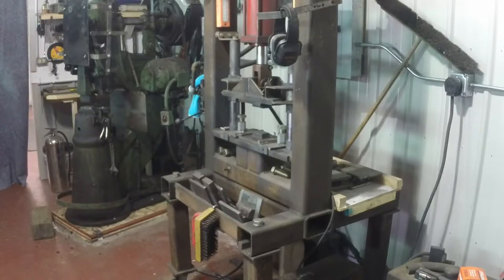Everything that I'm doing right now is really not all that significant, but all I'm trying to do is just increase my layer count. So remember, we started with 12. I'm going to draw this out a little bit more, cut it into 3, restack it, re-weld it, draw it out, cut it into 3, restack it, draw it out, it'll be 12, then we'll have 36, 108, and for a single twist, I might just double that last one and go to 216 layers. I don't really know yet. Depends on how I feel. But anyway, I will do another draw here right now.